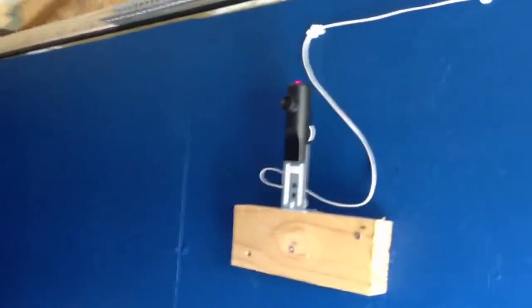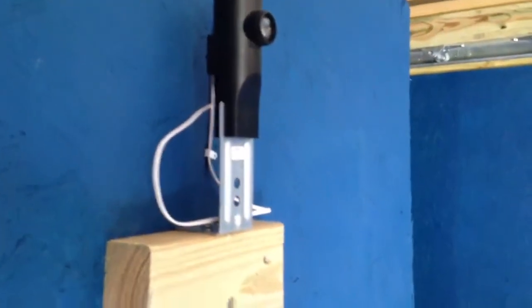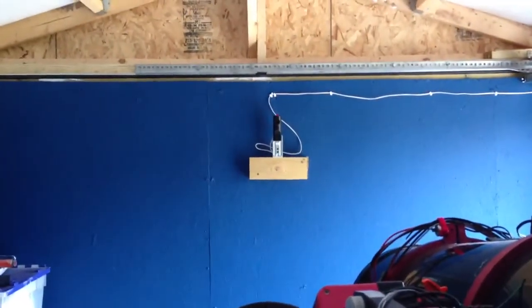We've got over here one of the electric eyes, and over here the other electric eye, which when the beam is broken will stop the roof from opening — which is a good thing since we're across from each other. If the scope is in the way for some reason, if it's not put away, you've got to keep the roof from closing on it.